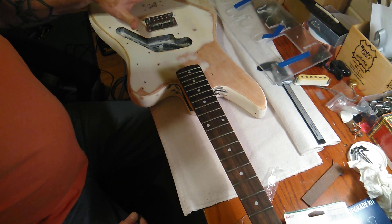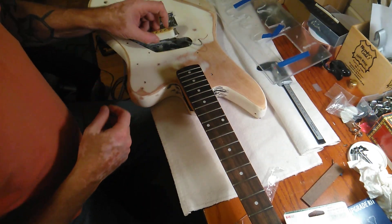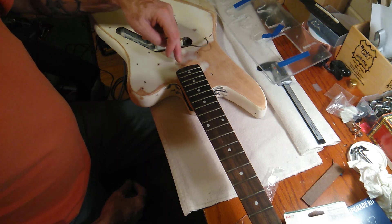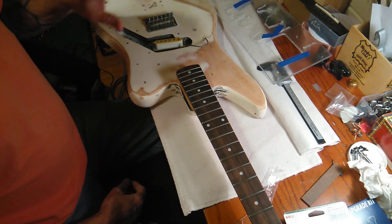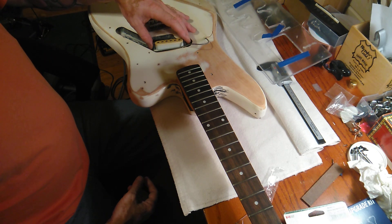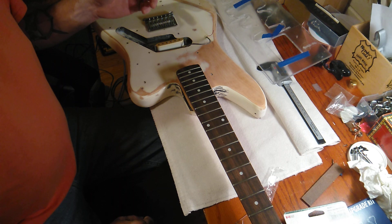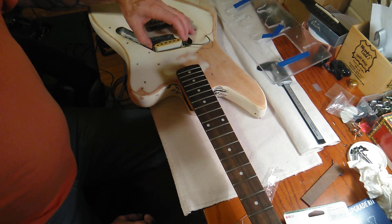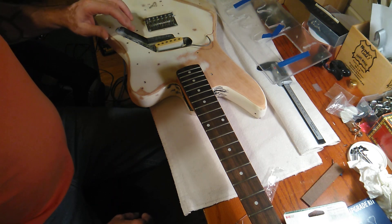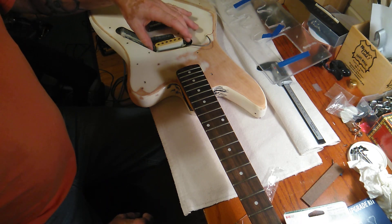We'll have this bridge, then the pickup — I'm not really certain yet, but I've got a pickup laying here just for reference. I'm thinking maybe a single coil, or I can route out more and do a humbucker. I can route it out and put a single coil or two humbuckers, whatever I want. I think I'm going to put a single coil in this position. I've got several of the blade-type single-coil-sized humbuckers — I think I've got some DragonFires that are four-wire pickups. I'm thinking just a volume and then maybe a mini switch to split that.